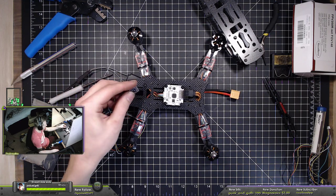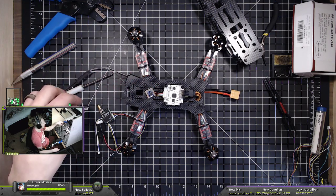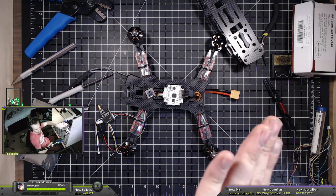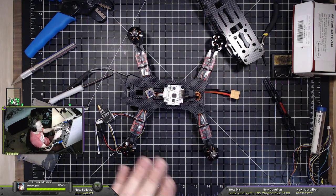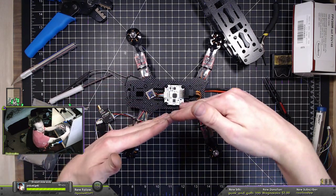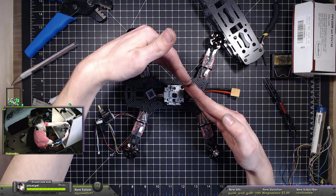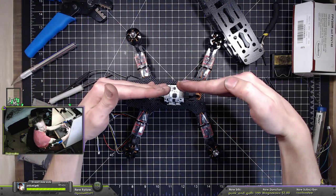So that'll help with monitoring battery voltage so you don't drain your batteries too low. And if you're looking at the sky, it'll give you an idea of what direction you're facing. Because once you're looking at the sky, you don't really know if you're tipped this way or tipped that way. You could be either way, and you don't really know. But that line will stay. So once the drone moves, that line won't be like this. The line will be like that, showing that you're tilted to the left. Because this is the ground line, and then once you roll back, it'll straighten out.